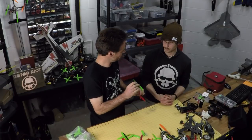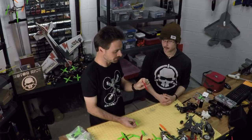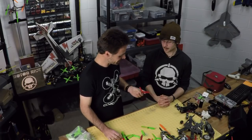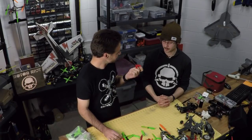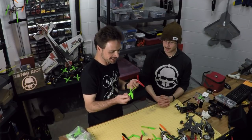This will provide a little bit more thrust and a little bit more RPM, but this one is a little bit more efficient. So this one allows you to run a smaller battery. Typically you'd run an 1800 milliamp hour pack on the bullnose if you're pushing hard. With the tri-blade you can run a 1300 milliamp hour pack. So the next question is — okay, we've got three blades, why wouldn't we go to four blades? Let's get six, let's get eight blades.